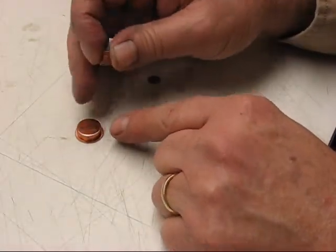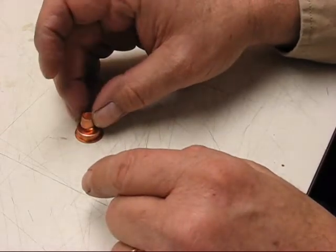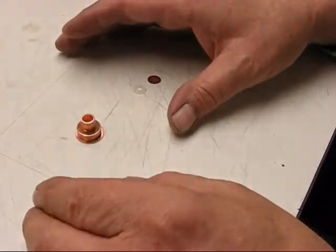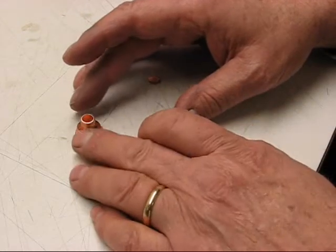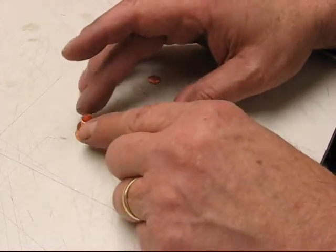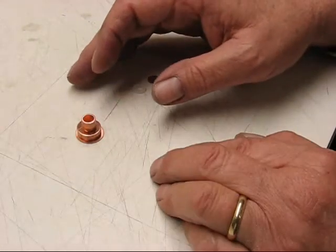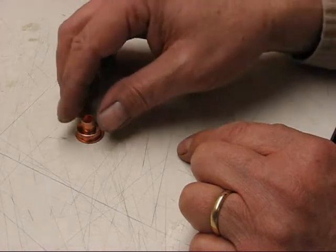What I've changed is I was using a plastic center post for the positive and now I'm using a copper center post for the positive. I'm doing that because I can solder that copper center post on and it's really strong, whereas the plastic was just glued on and I didn't really feel good about that. That's a 1/4 inch copper tube — 1/4 inch ID — which measures probably more like 3/8 on the outside, and it's 8 millimeters tall.